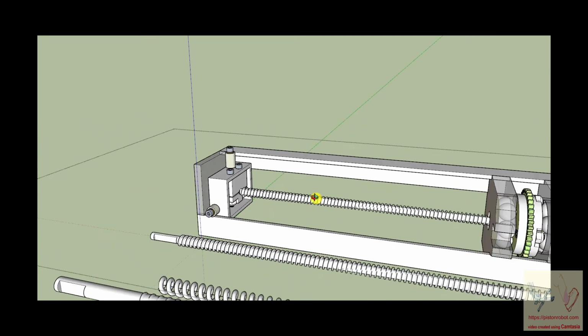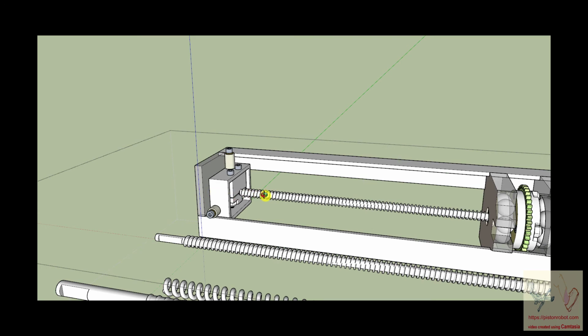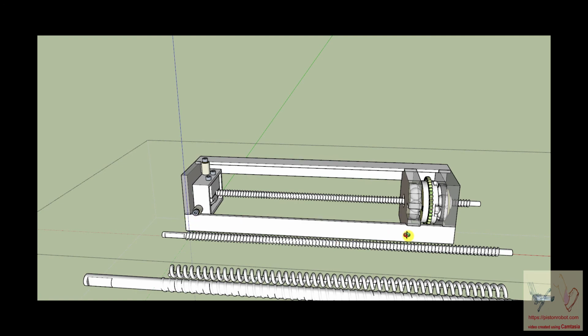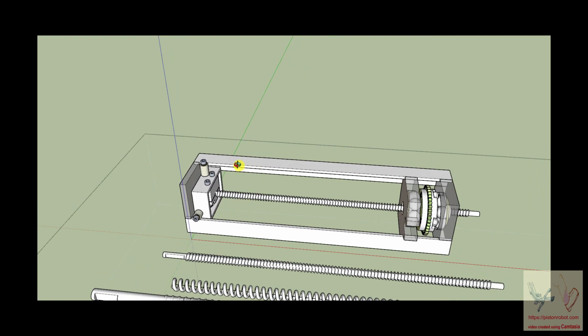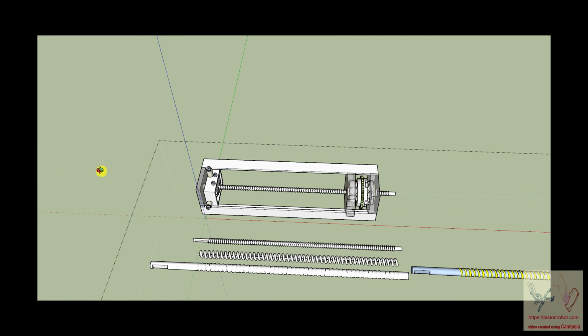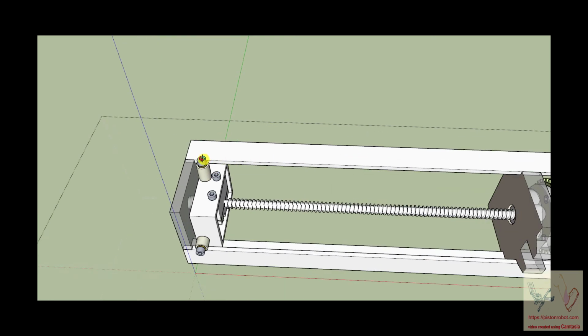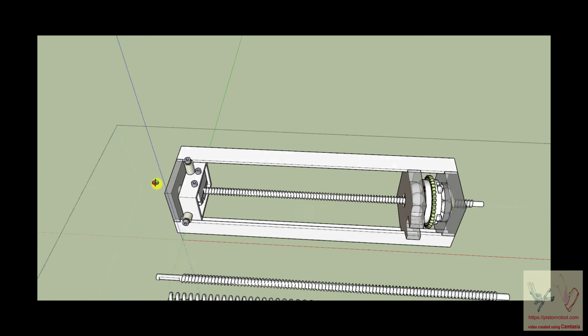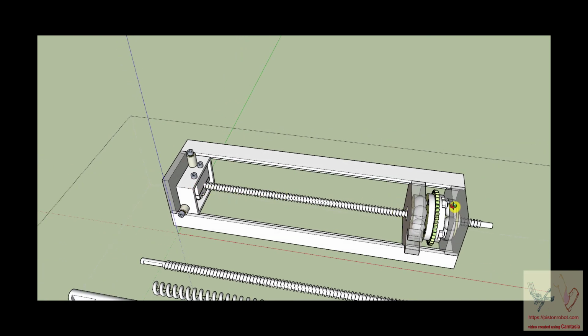And the strength of its ability to force this ball shaft forward is related to the rigidity and strength of these angles. So while the whole entire structure itself can move around, like if the robot was walking, it has internal rigidity, so that because of these little rollers up against these angles, and because the angles are bolted together to these end pieces on each end, the only thing that this can do is go that way, or go forward or go backward.